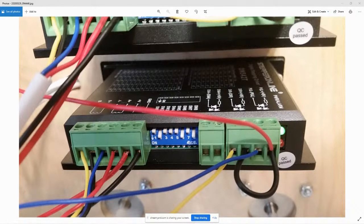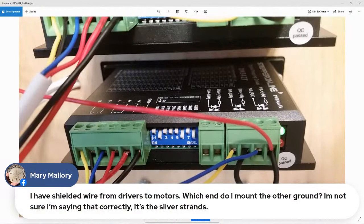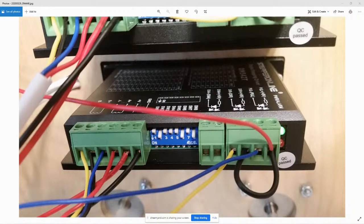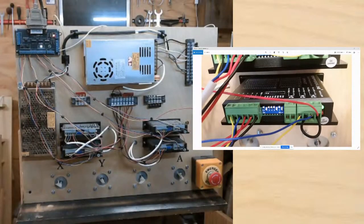What we're saying, Mary, is to run it as it is first and see if you have a problem. I don't think it's going to matter which end you connect to ground because you're only connecting one end. If there's anybody out there who knows for sure, go ahead and pipe up in the chat. Wade says he grounds at the controller, and Dave says he's got his tied together in the controller box — it makes more sense logistically to tie them all together at the box.